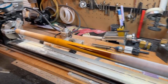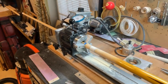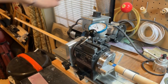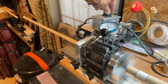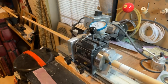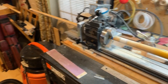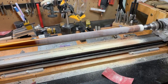For now that's kind of what we're doing. I've got the whole cue in the lathe right now. Let's turn it on and we'll see how basically straight this thing is. The tip end has a little bit of a wobble but that could just be how I have it mounted in the lathe. When I put it in end to end between my centers it's totally almost perfectly straight. So I think this cue is actually going to be a great player for someone once I'm done with it.